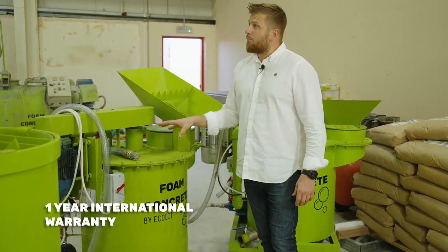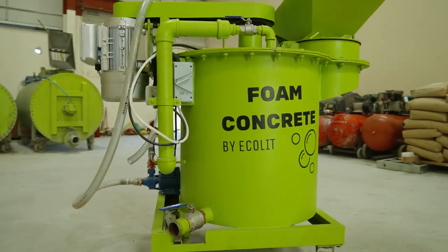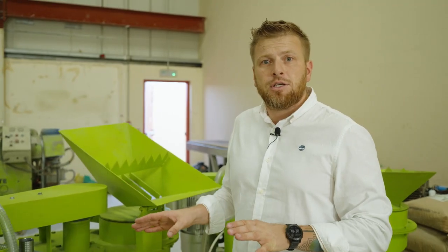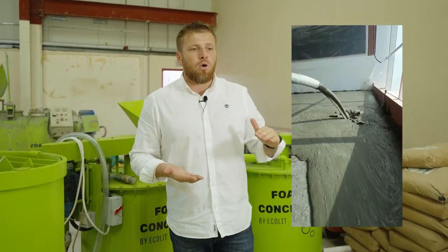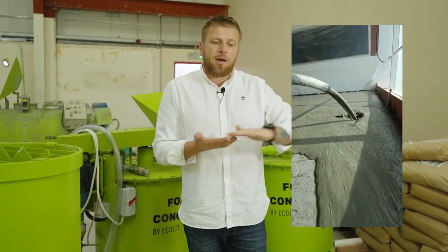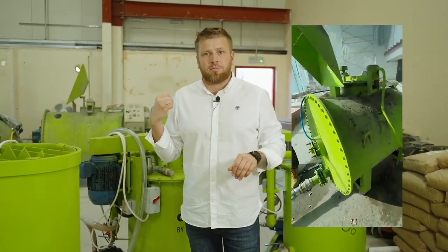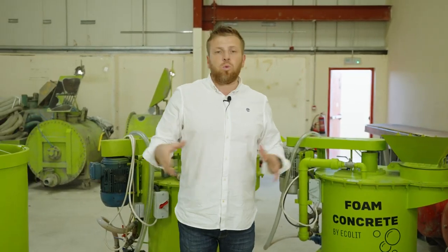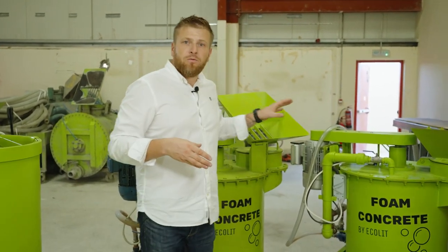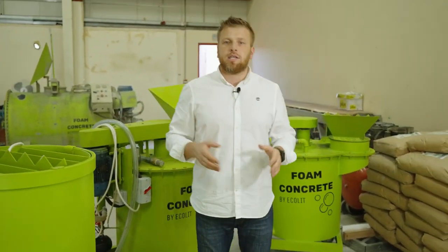This mixer runs at around 400–500 RPM and is used especially to create lightweight concrete from 600 to 1200 kg per cubic meter density. This type of lightweight concrete is very suitable for floor screeds — where tiles, vinyl floor, or carpets will be the finishing covering — and for rooftops where you want a base to place AC ducting systems, water tanks, and so on.